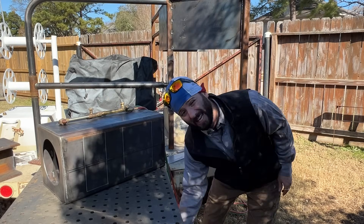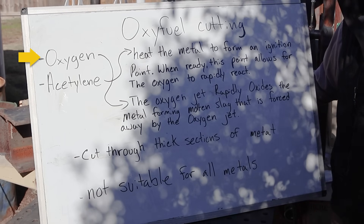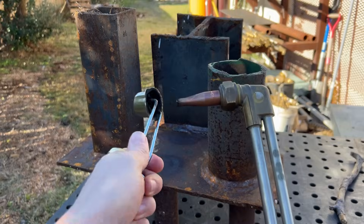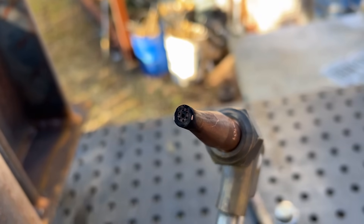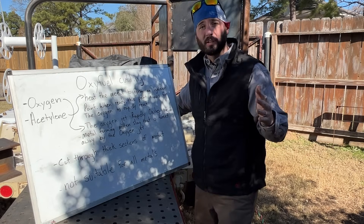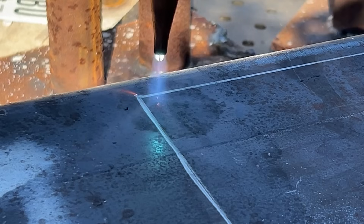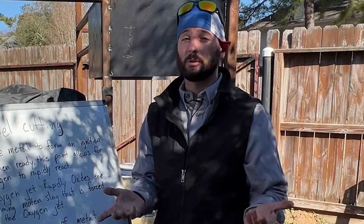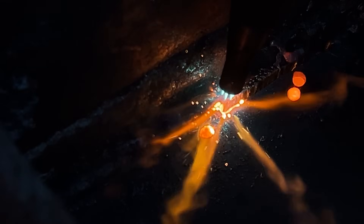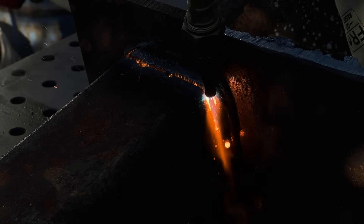If you don't know anything about the oxygen and acetylene cutting process, now is a good time to get into some of the theory. With oxy fuel cutting you need at least oxygen and some sort of fuel — today we're going to focus on acetylene. You can use a different range of pressures with your oxygen to your acetylene according to the metal thickness and the cutting tip you're using. One of the fundamentals is what these two gases even do to your metal. The acetylene gets that metal nice and hot, getting it ready for that oxygen to rapidly oxidize — not melt, which most people think — it rapidly oxidizes and burns the steel away. You can cut through crazy thick metals with it.